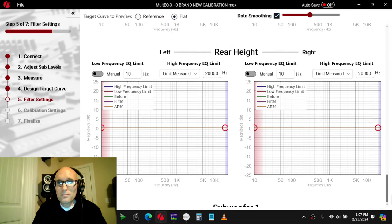But none of the crossovers are on. The delay is 0. There's no gains. We're not inverted. Compressors aren't turned on. I've disabled all of the basic modes and advanced modes. All the potential EQ is turned off here. This is highlighted still, but it's only because they're enabled, right? They're ready to be imported too. But we're flatlined here as well on the miniDSP, so there's no actual files or anything being applied there.